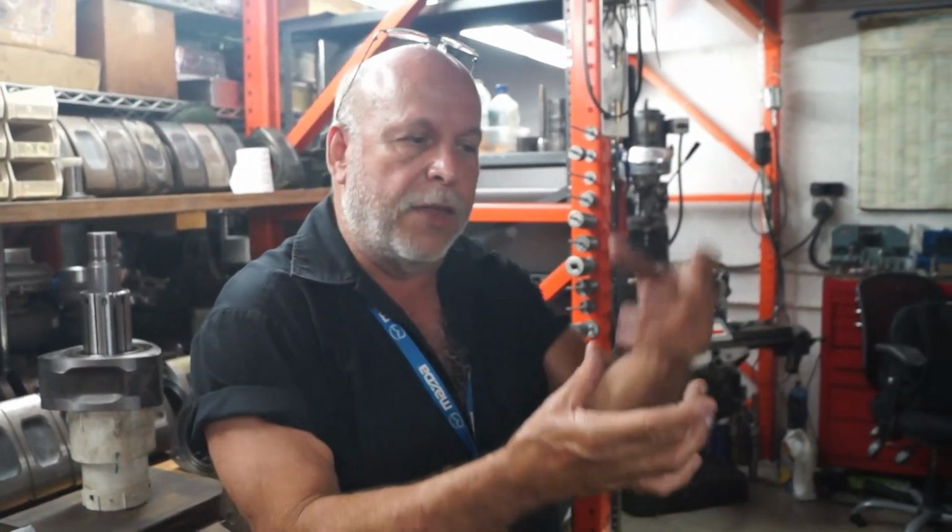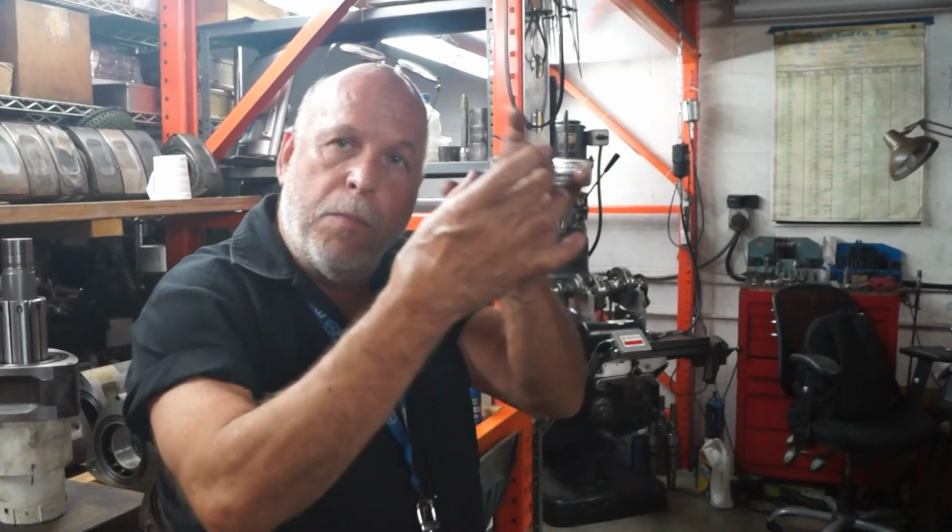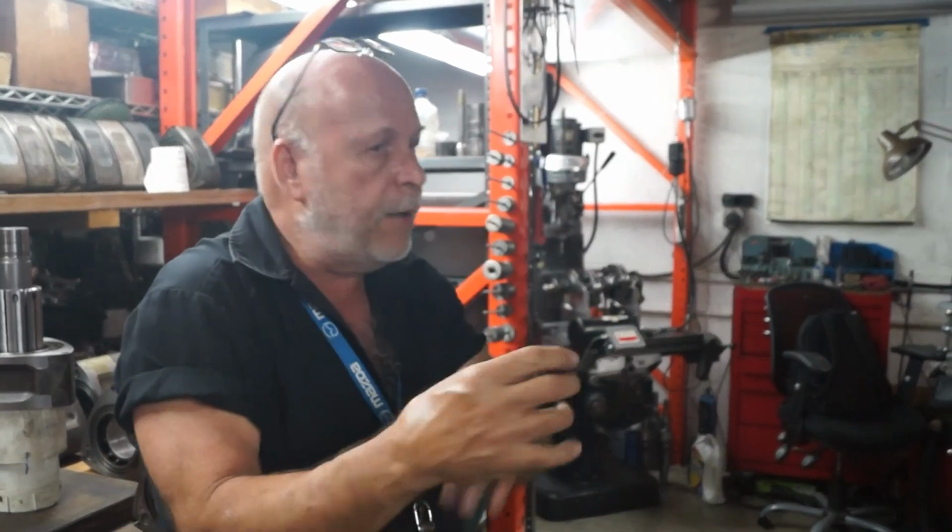Then you weigh them again. Now they're going to be much closer. Both big ends and small ends of the connecting rod are equal to each other. Now, since you've removed weight, you have to weigh the whole part again, and whichever one is the lightest, you take material from the other ones from the beam of the connecting rod. Once you do that, you weigh the connecting rod, and those are relatively fast operations, because you're dealing with production parts, not casted parts, that are stamped, and they're all physically the same. So the changes are very minute, and then you weigh them all, remove from the beam of the connecting rod, and that's it.